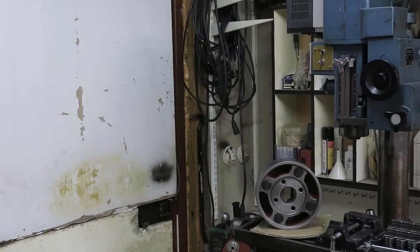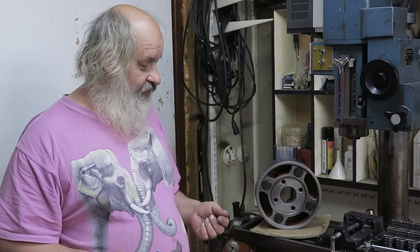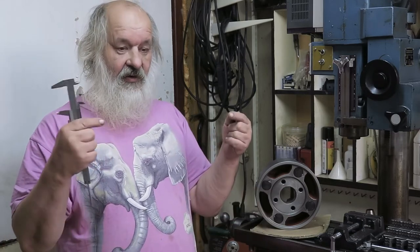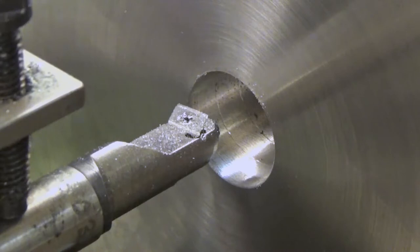Well, let's measure it. It is not just a little bit, the spindle bore is actually less than 50 millimeters. So we don't make it 50 millimeters, we make it equal to the spindle bore. And then we make a chamfer into there. The reason for this is not to damage the Morse 5 taper in there with your stock when you put the stock in. So therefore I don't want there to be ledges inside the hole. I want there to be a chamfer from 50 to, probably, I will measure what it was in the lathe, but it's less. So the spindle bore was actually 36 millimeters.